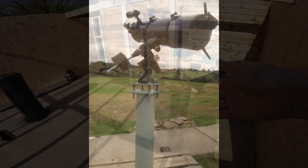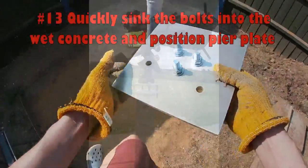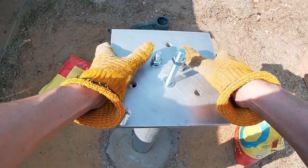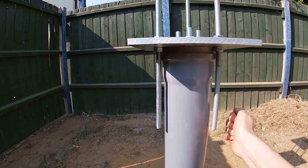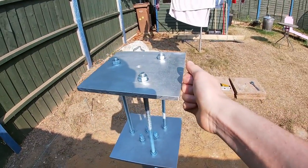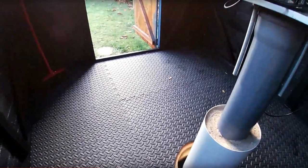It's still very cheap in this construction. You should find many videos online showing step by step how these piers are built. I did come across one warning about going a bit too thin with the pier construction. Chris from Astro La Vista posted a video saying essentially 'learn from my mistake' — he initially used only 4-inch pipe, and because of the height of the pier it ended up a little bit wobbly. He did fix it, made it wider, and is continuing to use it successfully. So all in all it's a good construction.